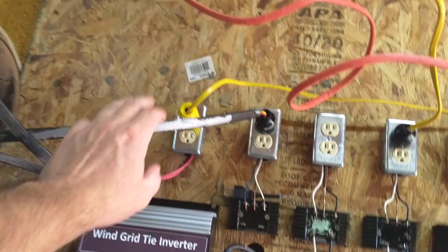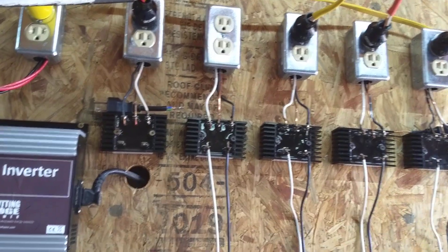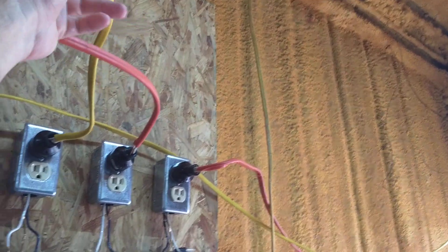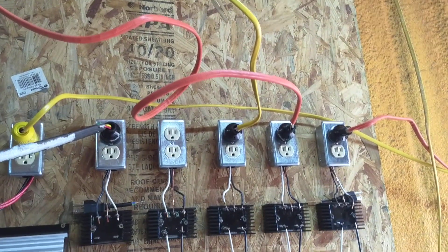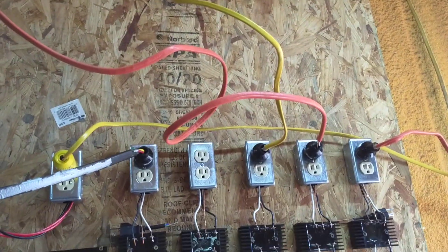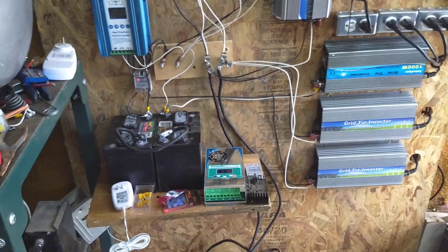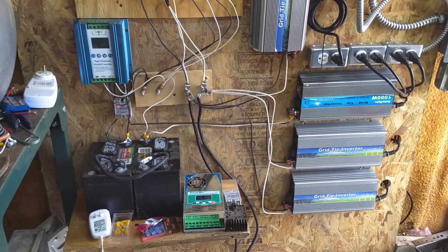The Healey is marketed as 48 volts only. The DIY 1500 is 24 or 48, and this 400 watt turbine is actually 48 volts — even though I run it at 36 it does really well there. I'm probably looking at running the Healey and that 400 watt turbine on one circuit by themselves at 48 volts. I think the output between the two of them will justify that. We'll see how that setup does. Stay tuned, more updates to come — thanks for watching, have a wonderful day.